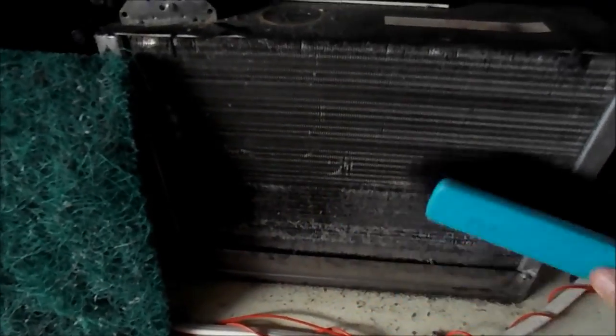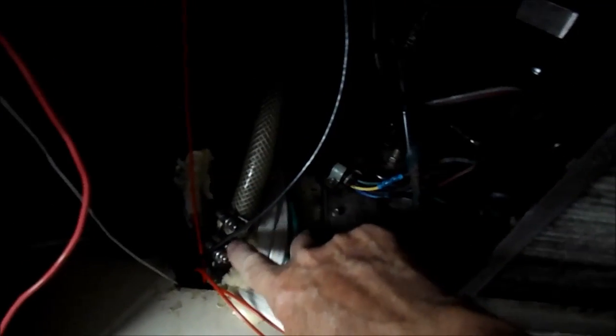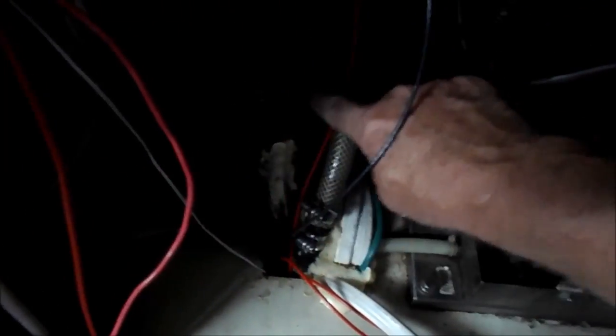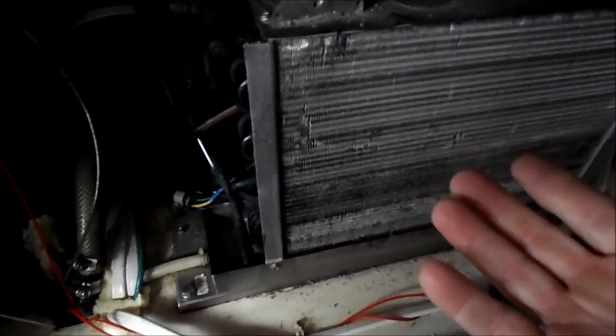So this is our Mermaid unit — this is the compressor unit. We're going to be cleaning off some of the coils here before we clean our filter. This is one of those washable ones, so we can wash it off and do it up later. You've got a reset switch here on the top, and then there are your cooling coils here on the side, your compressor back here, and then the water intake comes out of this tube right here. That flows into your system and that's what does the heat exchange, which is very important for the system to run properly.